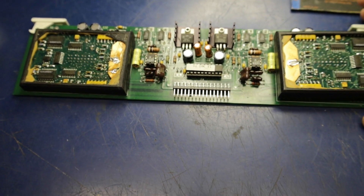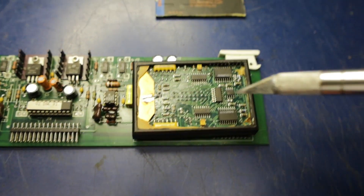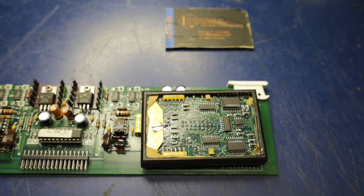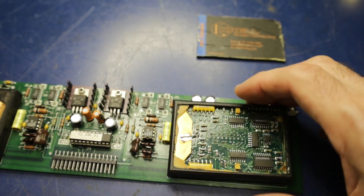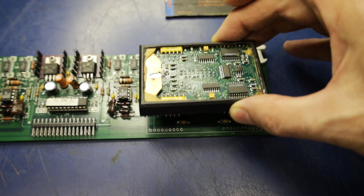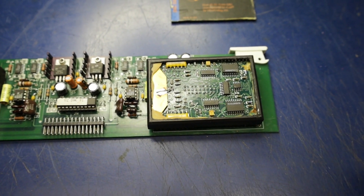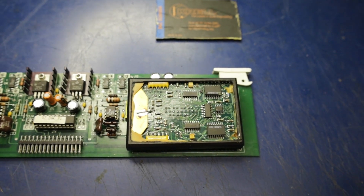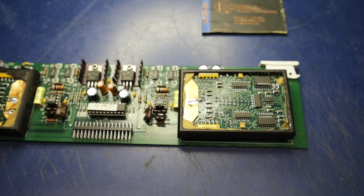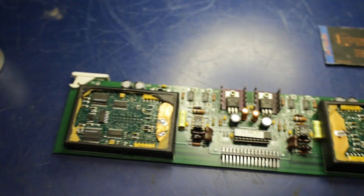I ended up taking it back apart to resolve that issue. Basically, there are these through-hole components, and I noticed a lot of them aren't soldered too well — especially around the edges, quite a few of those as well. You just have to reflow those and may need to add a little extra solder to some of them, then remove the flux and put them back in the board. That resolved the dropouts and noise on both DACs.